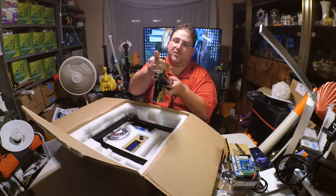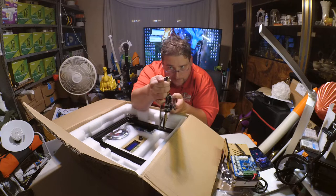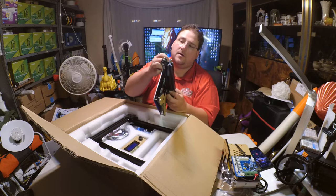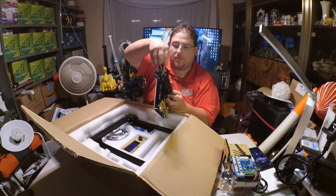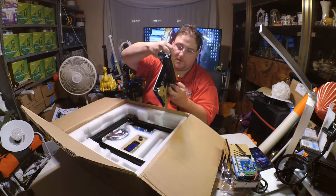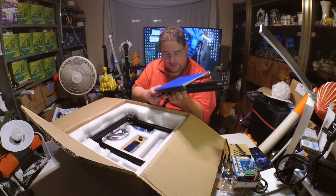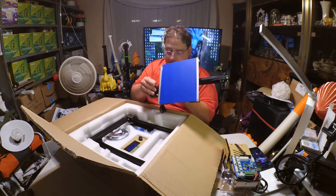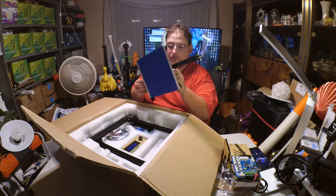It is definitely prone to jumping. If you watch carefully, you can actually see that nut turning as I do that. So, nice tight springs, but I'm probably going to want to use stiffer springs in the long run, but otherwise not bad. And these nuts are a bit small to be comfortable to use, but that's okay. This is a cheap printer. Looks like the Y motor is already mounted. Belt is already installed and tensioned. It seems fine to me.